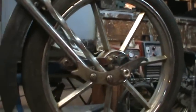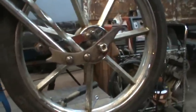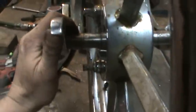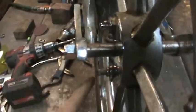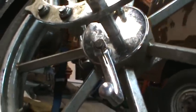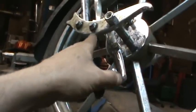See the fender travel too. Now it's sitting at ride height and we've got this much distance between the lever. As it goes over bumps it does get closer, but I don't think it's ever going to get close enough for the body of that lever to run into there. I think I have more than enough room. If it does hit, I don't have a solution for it because that's about as far as I can go.